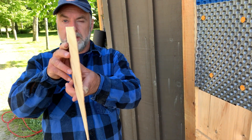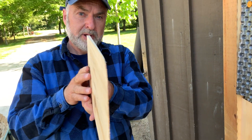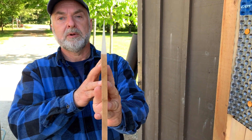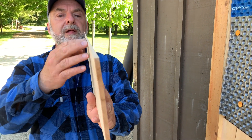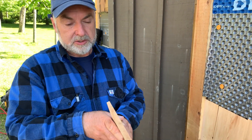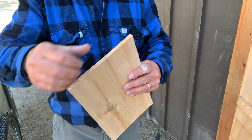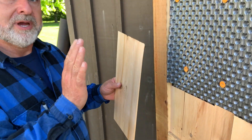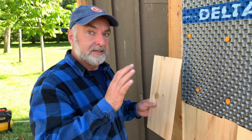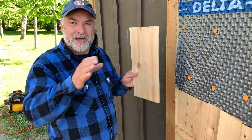Can you see how this shingle is curved a little bit? Almost all shingles have a little bit of a curve this way, and also a curve this way. You want the concave side in towards the building, because if any more concavity sets in, it's going to be curving into the building and not curving out with edges sticking out.